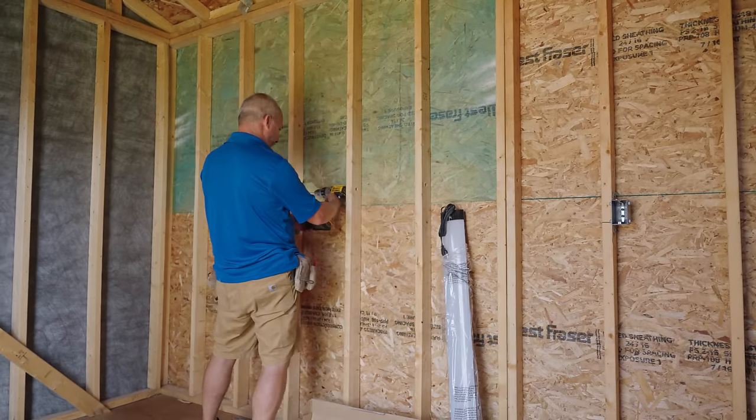in order to communicate with the rest of the world at another future date, I'm gonna put a little bit of black tape on this white wire at the end so that everybody else around here knows what's going on. So you could open up, let's say the light stops working, and you open up the switch, you pull it out of the box, and then you see this tape here. You'll instantly know that I wired this as a switch leg, okay? And then you'll know exactly how to solve this problem. So if this switch looks good, you'll know what to do when you get up to the ceiling light box.